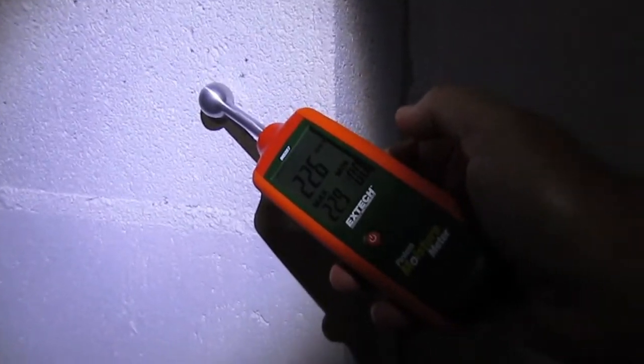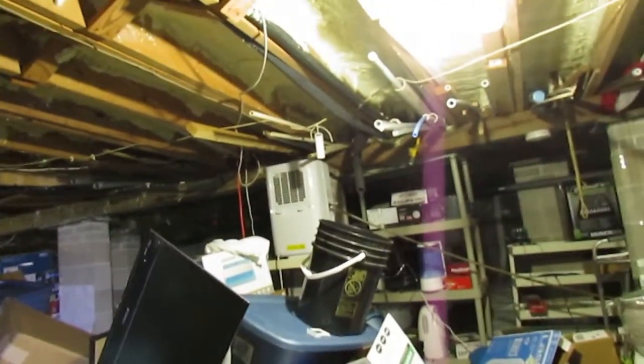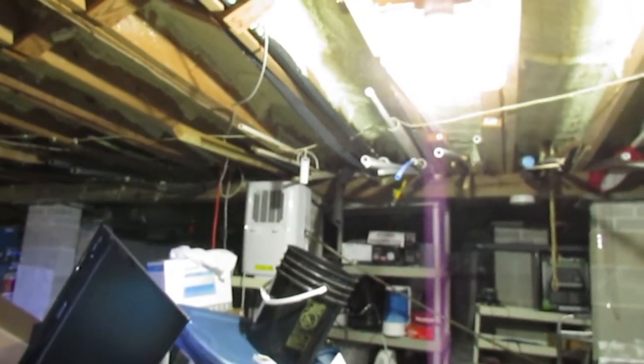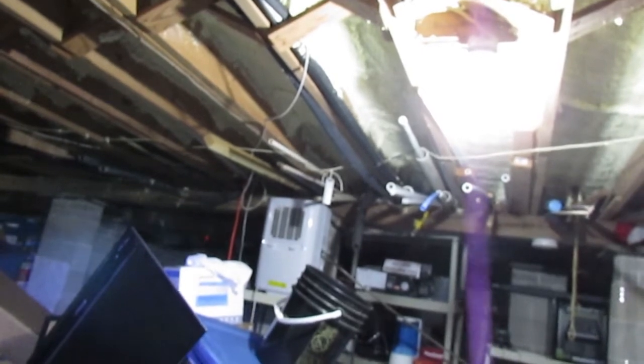Let's see what the moisture level on the interior wall is now. It's showing 226 — at the beginning of this episode we were almost at 500, well into the 400s as far as moisture. I've done a fairly decent job, though there are still corner areas where I didn't get any of the DryLok and I'll go back with a brush to seal those. My dehumidifier is not running nearly as much as it was before — it's not having to work as hard to keep this space dry, saving me money on power.